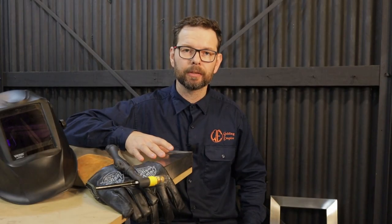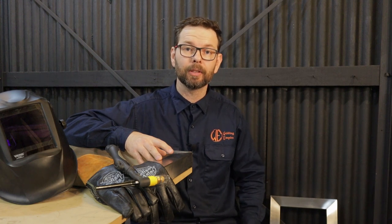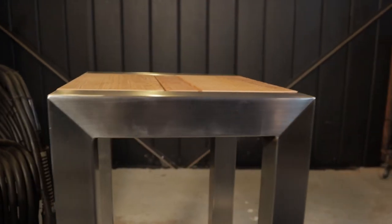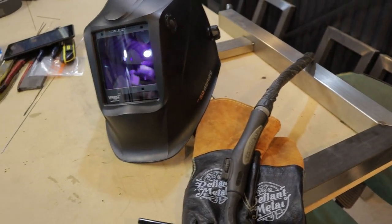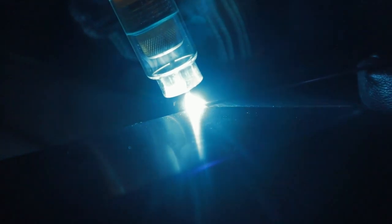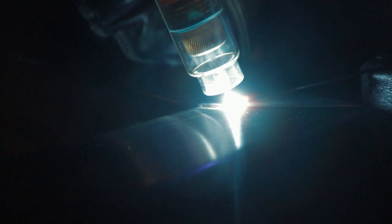I've tried to adjust the camera to get it as close as possible to what you see behind the hood, but because of the camera I can't get it to look exactly the same — I can assure you it actually looks a lot better in real life. This is one of the projects I'm building on my YouTube channel — I'll put a link in the description below. The material is 2 inch by 2 inch with a 1/16th wall. I have my welder set to 44 amps and the flow rate at 17 litres per minute. The filler rod is 1.6mm or 1/16th 316L Si. As you can see the helmet is very clear — it's set to shade 9 but the camera sensors can't detect the tungsten or the puddle correctly. I'll improve on my camera skills as I release more videos.